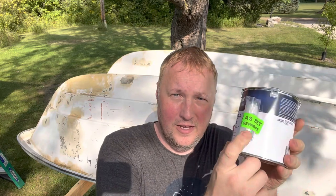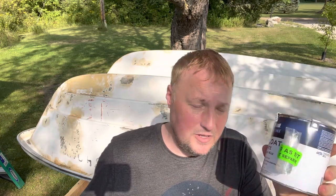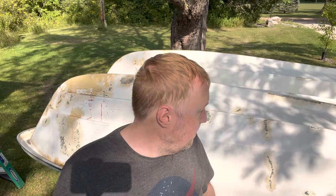It's the white and it contains the wax. It has the catalyst, which it needs to create the hardening. Something that I learned through mistake is if you get the one without the wax, it dries tacky. It won't dry hard. So you need to create some kind of thing to cover the atmosphere, like a wax paper or a PVC or something to get it to harden.